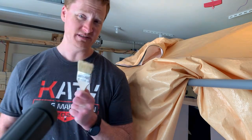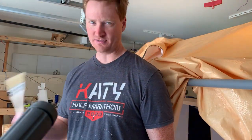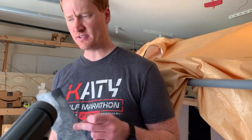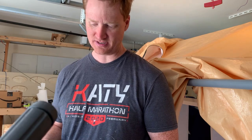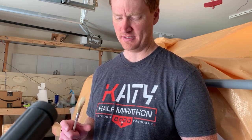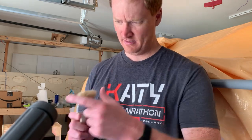It's right here somewhere — but this is the quality entertainment you come here for, right? So the first thing we're going to do is take this freshly painted cabinet, go over it with some wet-dry sandpaper just to rough it up a little bit and make the future coats stick. Then we're going to take that black paint and spray it in a plastic cup, or you can do the lid if you want, but it makes a mess. Get a little paint in there, dip the brush in, and make little dots.